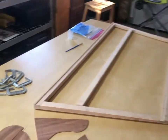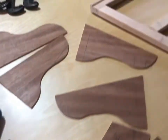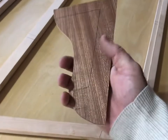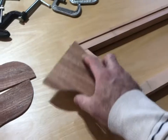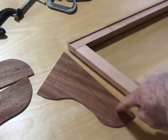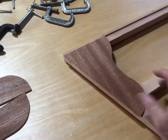Let's glue some stuff up. Got my T-88 right over there ready to be mixed up. The gussets are cut, and there are some pencil lines that correspond to the frame of the rudder. When I mix up some epoxy, I'm going to apply it here and also on here, then clamp them down on both sides.